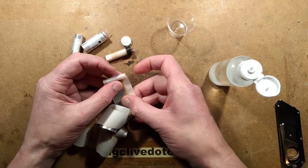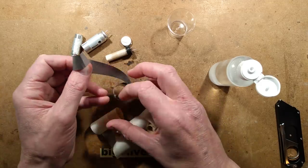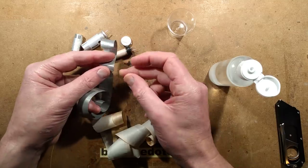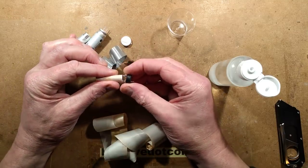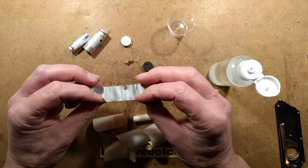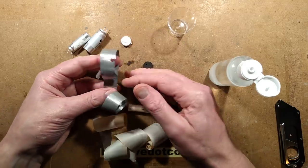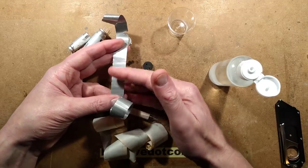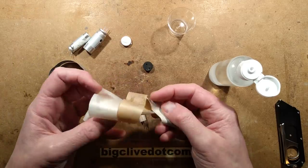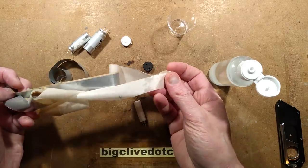I wonder why they've got this — is this just a standard size designed to keep it in a certain position within the container? Here's one section of the foil. The foil normally has — you can see it ripped out here — it's got a little thing spot welded on, a little terminal. Those are the terminals that go through the rubber seal at the bottom. The foil is textured; it's been etched so that it has a sort of three-dimensional surface, giving a very large surface area when the electrolyte goes in. There are two of those foils separated by the insulating layer and what appears to be the absorbent layer for the electrolyte.